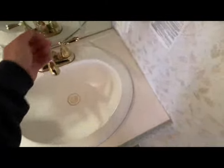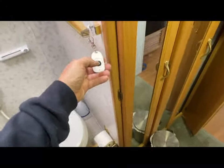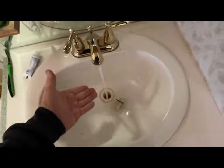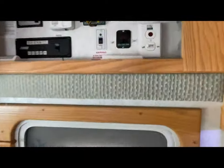You can always test it — usually when you turn it on you can hear the pump running because it has to build up a little bit of pressure. What I find works best is after turning it on, I just shut it right off, then go ahead and flush the toilet or whatever. The pressure that's built up is usually enough for what you need. Then as the water dies out to nothing, you're verifying the pump is off — a nice little trick.